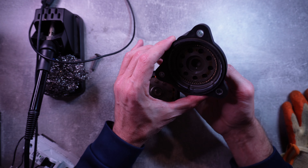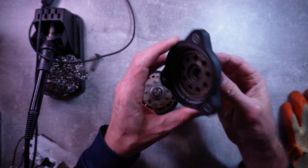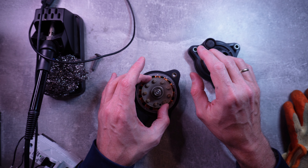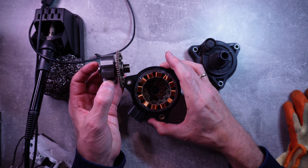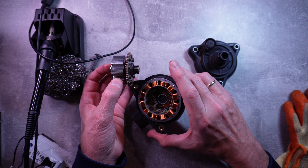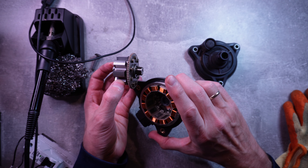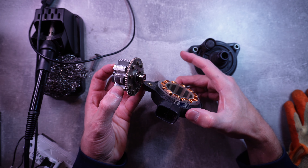Right, I've taken this apart and it looks like this is the part that is driving the gear. This looks like a BLDC type of motor with magnets, and I think those things there are Hall effect sensors. I suspect I could be able to run it with just a normal BLDC driver type of board, which I think I'm going to try.